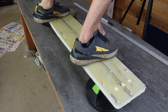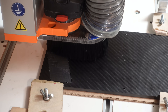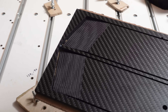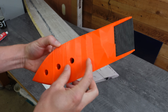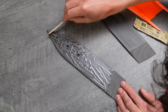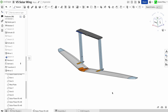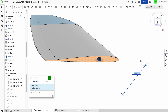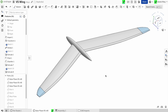It ended up being probably just barely strong enough. Next, it's time to make the things that will attach the masts to the wing. For this I'm using some 5 millimeter carbon fiber plate, and I'm using the CNC router to make some chamfers in it as well as cut out the contour of the parts. Those plates fit right into 3D printed parts that I made on the Prusa XL out of PETG, using dual extruders so I could make the support material out of PLA. Those two things got glued together permanently. If you want access to this CAD design, it's available at the Onshape link in the description — Onshape is a cloud-based CAD program, so all you need to access the files is a web browser.